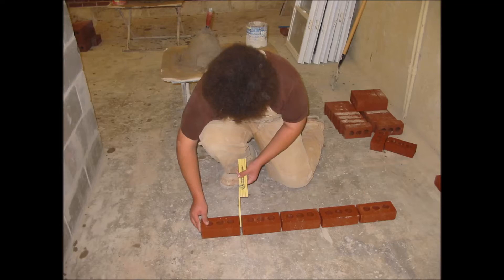After you determine where you're going to place the corner, the next step is to dry lay it. In this picture I'm using a roller to make an equal amount of spacing between each brick. For this corner I am building it nine courses high, so I have five brick going in one direction and four brick in the other. This is the proper way to start the course to make sure that all the spacing is even and give it the strongest bonds that it could possibly have.